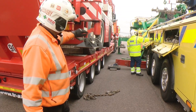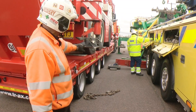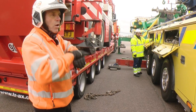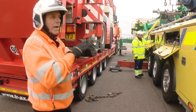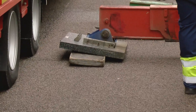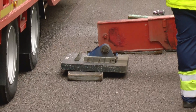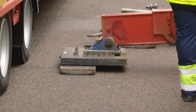With the rear leg, to make sure we had maximum stability, we put an extra block under it so the leg was pre-loaded before we tried to lift this big crane — that really helped with our stability. Callum's just going to take that up now; it'll go up and then he'll fire it in, and then we'll be ready to start moving this trailer around.